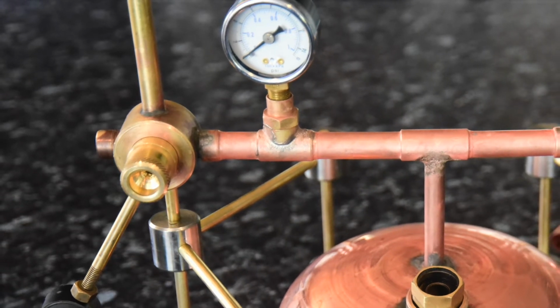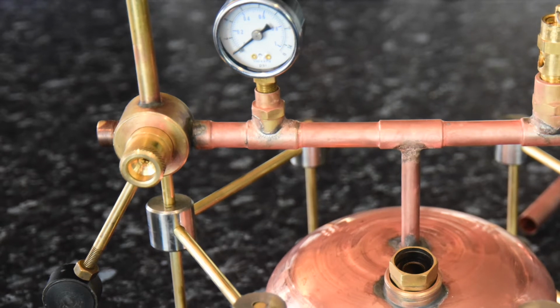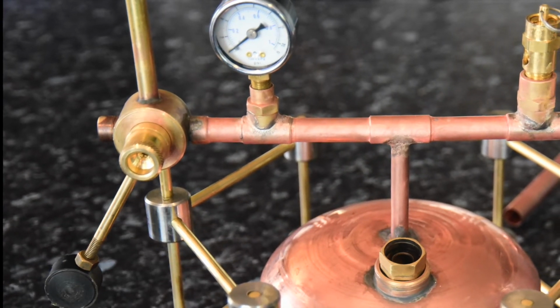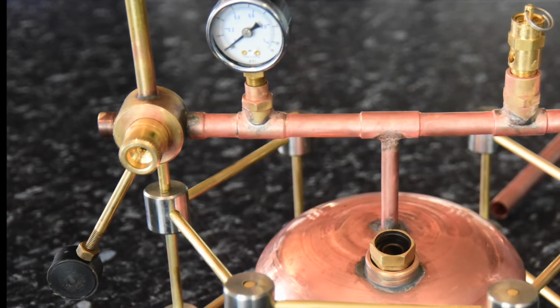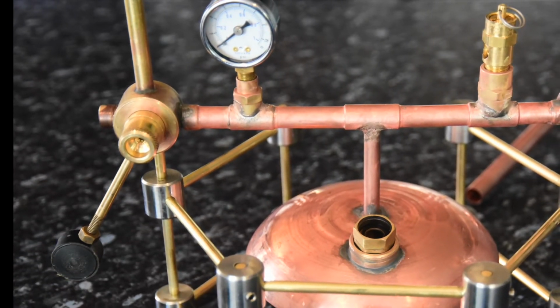Atmospheric pressure is about 14 pounds per square inch, so what I wanted to achieve was 1 atmosphere, and at that we should have the steam reach the speed of sound in the jets and reach maximum possible velocity, and so that was the goal.